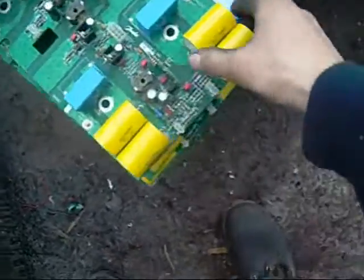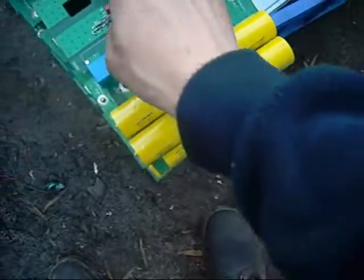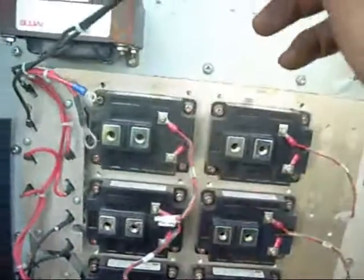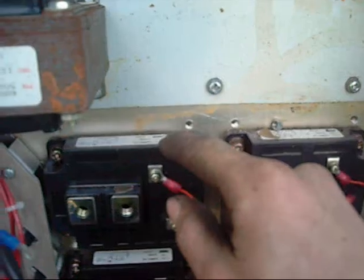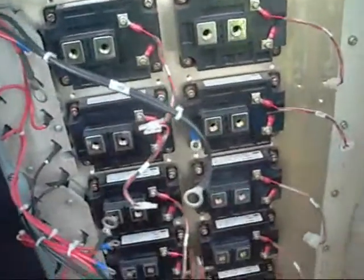There's the boards — they have nice caps on them. These things here drive both the gate and the emitter; there's one there for two, one there. The IGBT bricks are the same — there are 12 of them. It's the CM400HA-24E, PRX brand, Japan. I'm guessing 400 is the amp rating, so when they stack them across the buses that's a lot of amps. They have big bleed resistors under these packs too — ceramic things, I think.